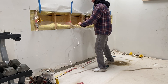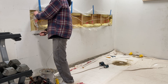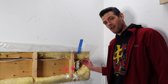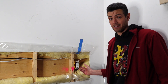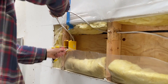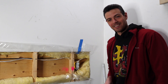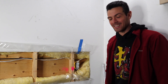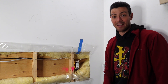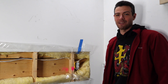Another tip my electrician told me: if you're running a new wire, put out a lot more wire than you think you need. It's a lot easier to cut a few extra inches off than to find a few extra inches that don't exist. I had like a foot hanging out, which is more than I thought I needed. I wasn't lying when I said I'd done a plug once — this was genuinely my first time doing any real electrical work, under the supervision of my electrician.